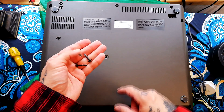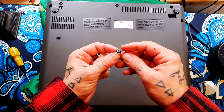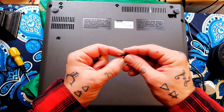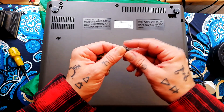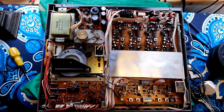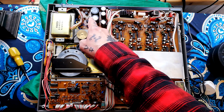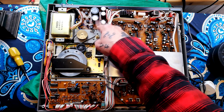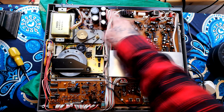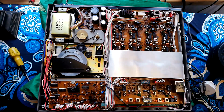I received this with most of the screws already removed, but they're of this wide ferrule type going into plastic mounting posts — a bit thicker than the ones we've seen coming out of 244s and 246s. The lid lifts away and we're looking at transformer power filtering and conversion to DC happening here, and possibly here by the looks of it, because we've got heat sinks for voltage regulators.